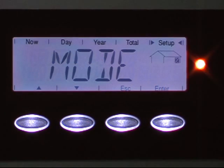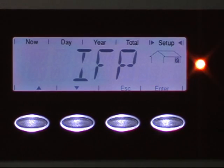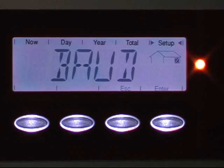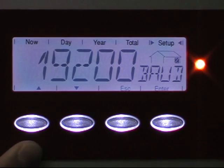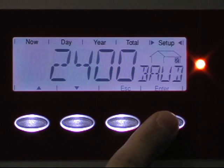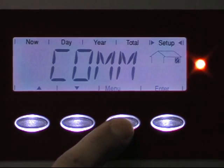Hit enter to go back to the mode. Hit the down arrow to go to the next section, which will be IFP again. Hit enter going into IFP. The first thing you will see is the baud rate, which we need to set up. By default, the inverter will be at 2400 and we need 2400, so normally you don't need to change it. But if it's not 2400 — say it's 19200 — use the up and down arrow to change it to 2400. Hit enter to save and hit escape to exit. You are done with the setup.